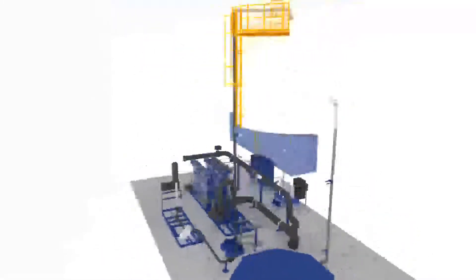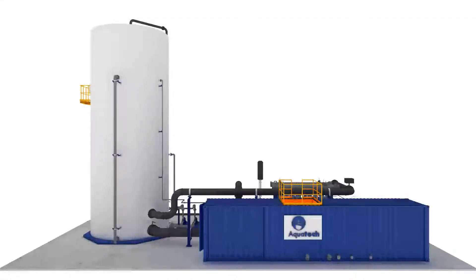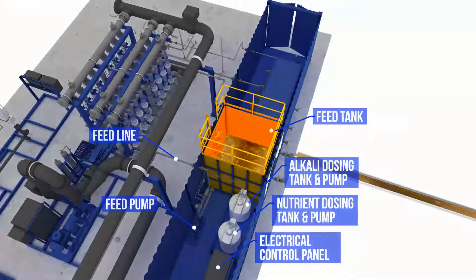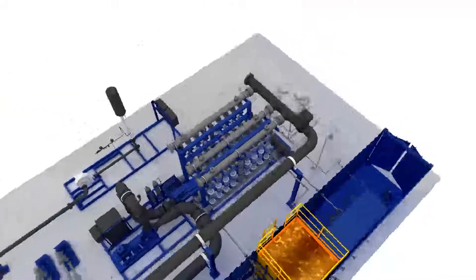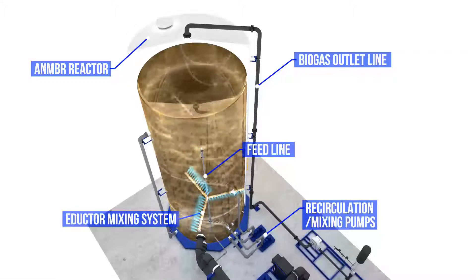Aquatex Biomod Anaerobic MBR is a sophisticated solution for industrial facilities with highly concentrated waste streams and slurries. It is completely modular, allowing the entire system to fit into a 40 by 30 foot area. The Anaerobic MBR includes feed pumping, a chemical dosing system, electrical controls, and product tank in a single container. Once chemical preconditioning is complete,